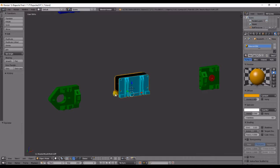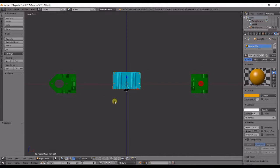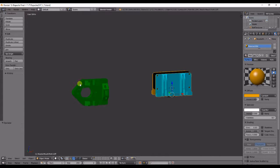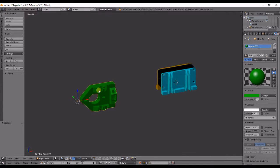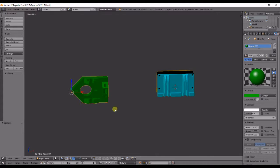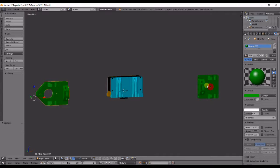So with the way I have redesigned this to fit inside the box, the threaded rod had to be over the Z motors, which is closer to the edge of the box on the outside. So I had to move that to this side and move the portion where the smooth rods go on the other side, and then I had to flatten this side over here. I pretty much modified everything here except for the idler cover.